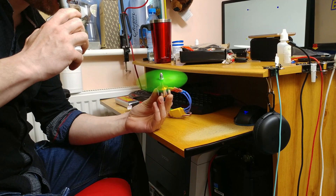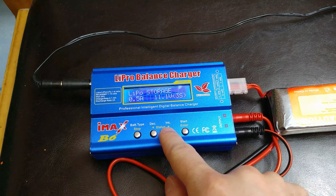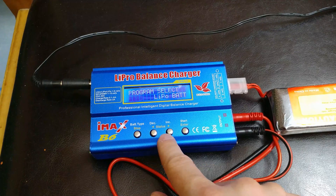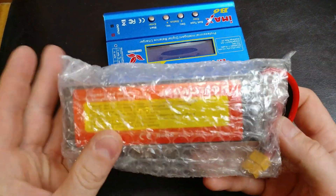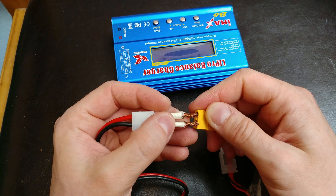I am very happy with the charger and will use it for my future RC projects and more. If you want to get one, check out the affiliated links below. Operation of the device is not difficult, but the tricky part is knowing what and how. Before using balance chargers, read and learn about different types of batteries, balance charging, discharging, and storage charging. The big disadvantage of lithium batteries is their flammability if used inappropriately — so stay safe and do not operate batteries or chargers without reading the manuals.